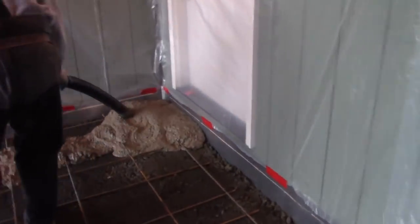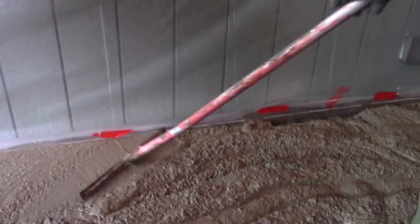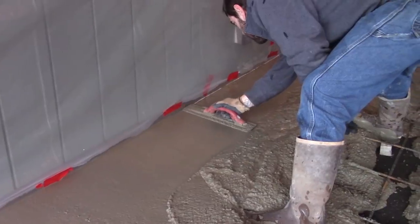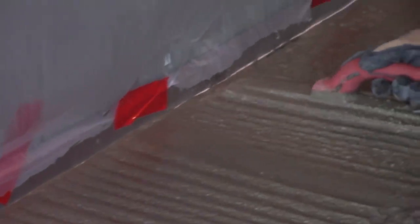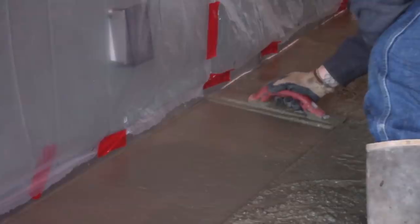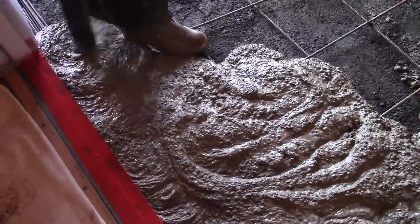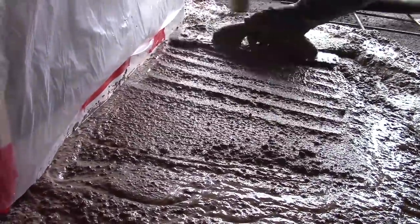But in this case, because of the elevation that I had to work with from raising the height of the new patio, allowing me to get adequate slope so the water can run off to the front of the work, would leave 2 to 4 inches of distance between the bottom of the new concrete and the top of the old. That distance was taken up with an isolation barrier of road fabric and half inch minus, which was compacted. A heavy rebar section was put in place with smooth dowels located at the controlled joint location so that when the cracking happened, there would be room for lateral movement. It turned out to be just, I think, a really, really effective way to cover up an old piece of concrete without having to bill the homeowners the considerable amount of money it would have taken to get this stuff out of here and haul it off.